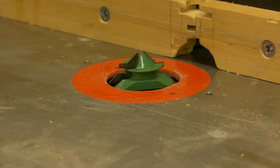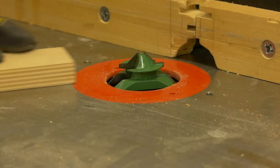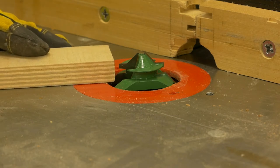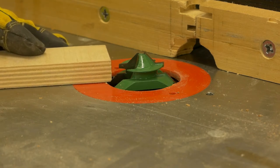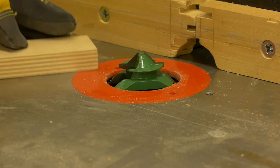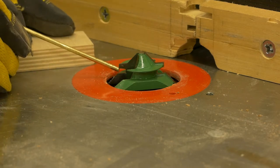So for theory into practice, as you can see, if I didn't have a groove cut the way I did, once I aligned the wood right next to the bit, the wood touches the lower part of the bit, and if I had a pencil mark on the wood, I have to be eyeballing when that pencil mark is in alignment with the lower part of the lock mitre bit.